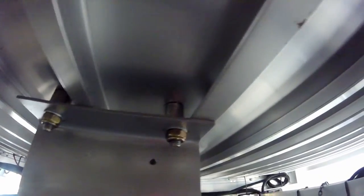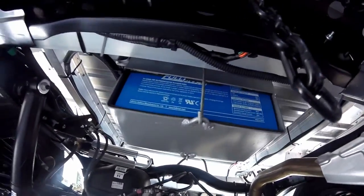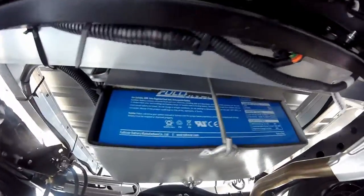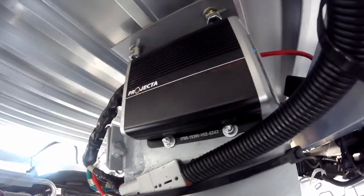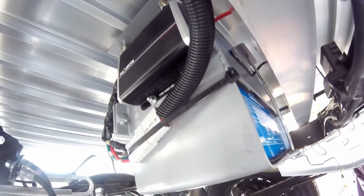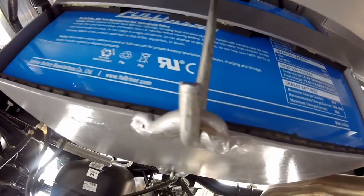To fit the battery it is juggled up between the differential and the box and then slid back into place. I'll be totally honest here — the battery weighs some 50 kilograms or 110 pounds, and moving it into place needs two people, both underneath the vehicle, one on each side of the basket. Working on my own, I have to cheat: I fitted the battery and electricals in the workshop, and then with the battery box sitting on a trolley jack, I wheeled it in under the vehicle, jacked it into position on the mounting brackets, and then fitted and tightened up the nuts. Here you're seeing the battery in position with the DC-DC charger and cables fitted. Note I've also fitted locking nuts over the primary nuts on each stud — this is a hanging basket and you can't be too careful.